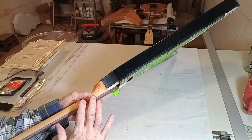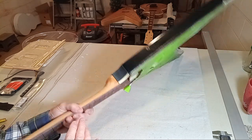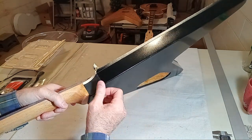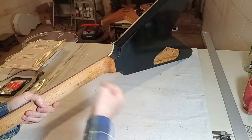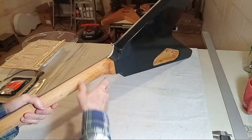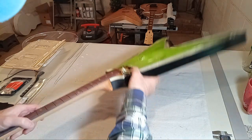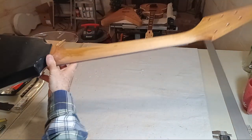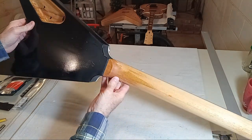This is what you kind of want to see as you're transitioning into getting very close to a finished guitar. It may not look like it, but other than this one little hiccup where I let the sandpaper hit that corner and knocked off a little bit of the black — I've got to touch that up — I've got 10 to 15 coats of clear coat nitro in this area, blending into the top. It's that close, other than the final buff work.